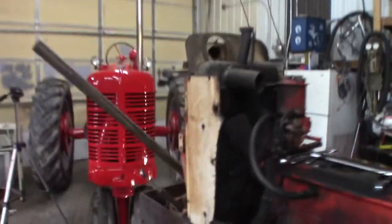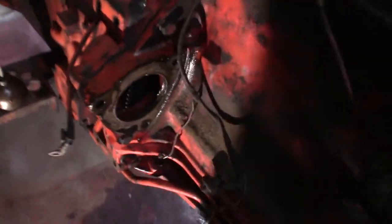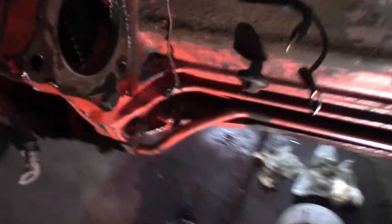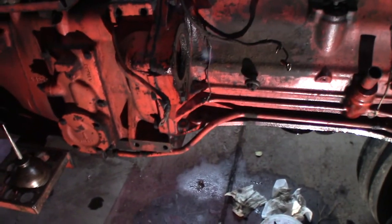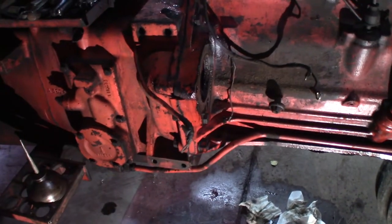Well, Kind of went off to work with Mark, so I'm here by myself, monkeying around with this old Case tractor. Which, I'm not complaining. Anyway, I got the starter off, which was stuck on there because that's gasketed. It didn't dawn on me before, but that whole thing travels in oil. The whole bell housing's got a gasket, everything, because it's got the Case-O-Matic in there.